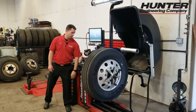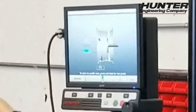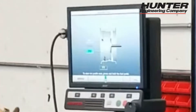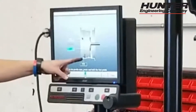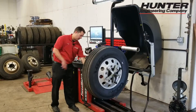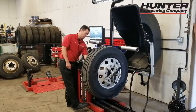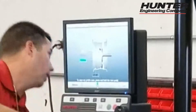If I rotate it down, it automatically looks for tape weights — which is what you're using on this wheel. So we're going to put our dimension in. The arm comes down for our inner plane, so put it right exactly how the picture is showing, then tap your pedal — that tells it where you want the mark.